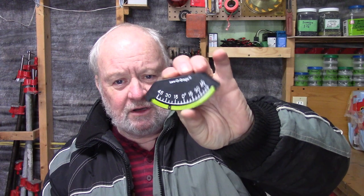So anyway, to try to ease my mind about how much the tractor tips when I'm plowing or pushing or working in different spots, I ended up buying myself an inclinometer. You see as that rolls, that little ball on the bottom rolls around. This inclinometer — I'm going to call it a level gauge because that's what it's called on the sign here. This level gauge doesn't alarm anything or stop anything. It just tells you what angle you are tipped to.